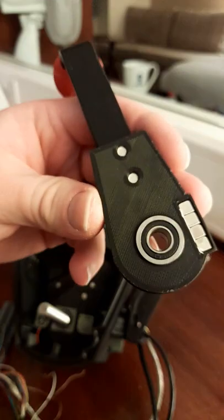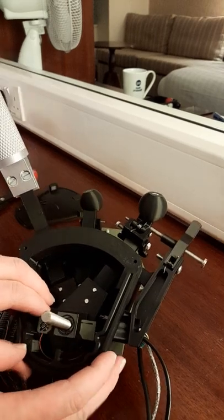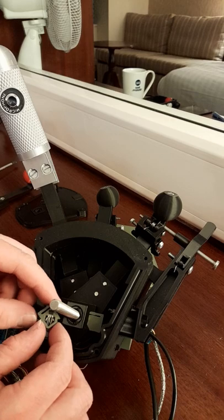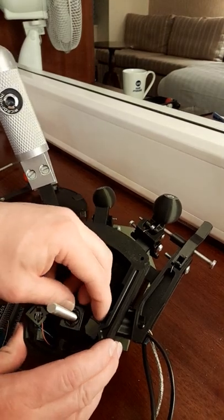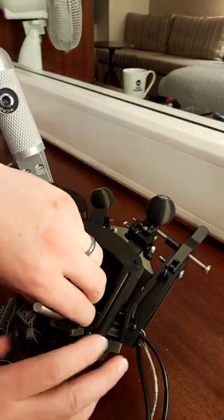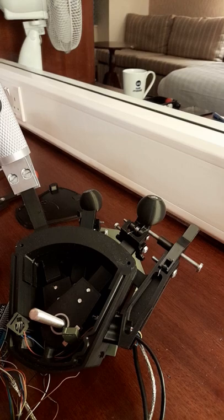The bearing in each side of this, we'll be taking them out in a minute. Inside here, you've got the Hall effect sensors. These simply unclip, so you can solder these all in sets of two outside. Currently, I haven't tidied up the wiring because I'm obviously taking this apart and putting it together quite a lot. This is the static part. Again, this has an adjuster on it.